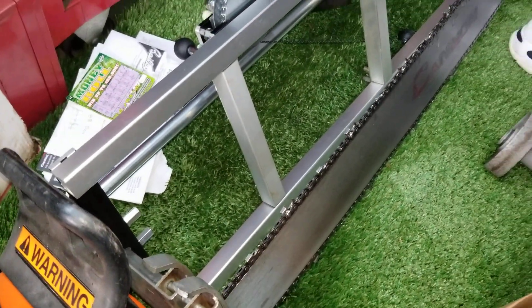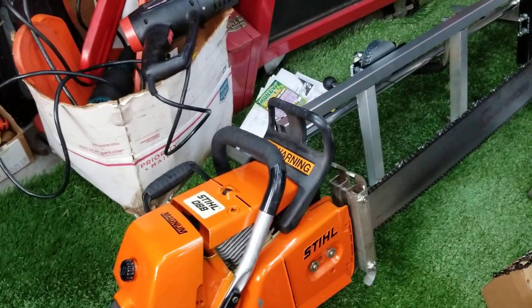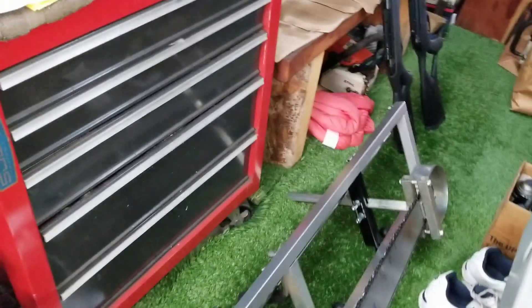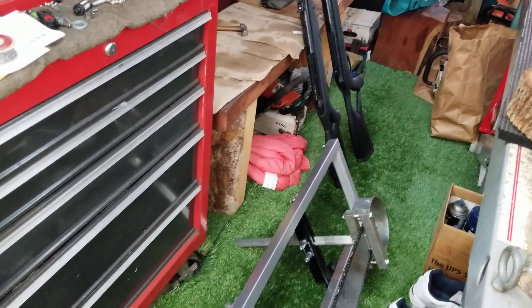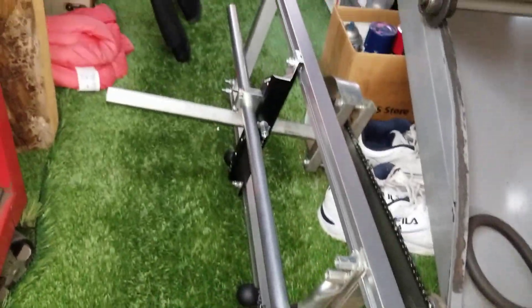I know it's going to take a bit of a bigger bite out of everything. I've got a 7-pin 404 gear on this one — I didn't run an 8-pin. I want to gear it down so the saw doesn't have to work too hard. I've got 35, 36 inches of bite with this bar right now. This is the mill with the crank and all that stuff — the hand crank that I did up yesterday that I made the Irate video on.